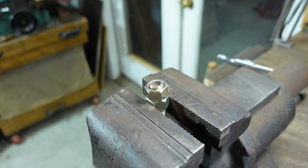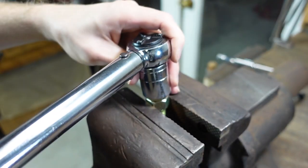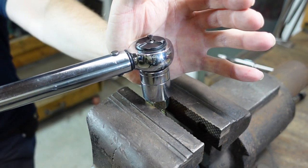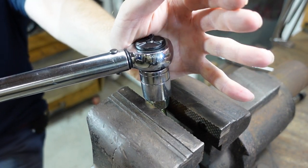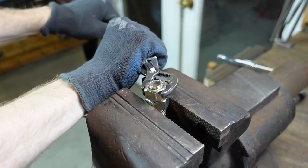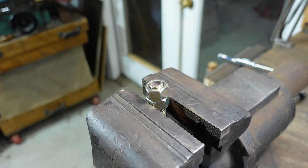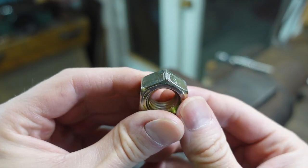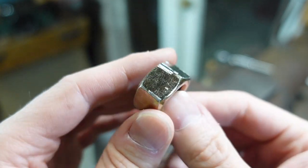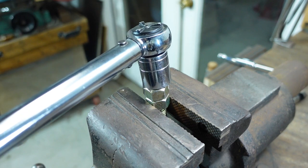They're 1 inch outside diameter, and we'll start off at 140 foot-pounds just to make sure it's right. 140 foot-pounds, half inch nut. You can see it's really tearing away the edges of these as well. So let's do one last test — 150 foot-pounds, half inch grade 8 nut.